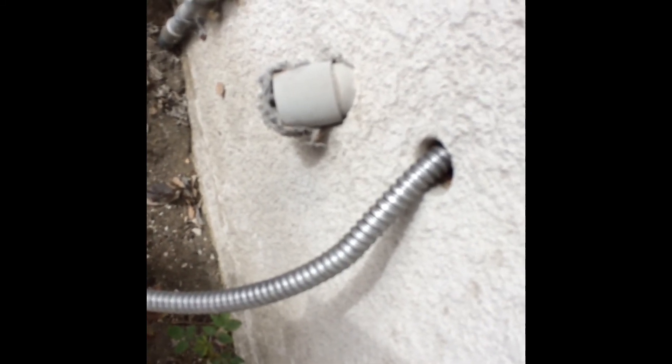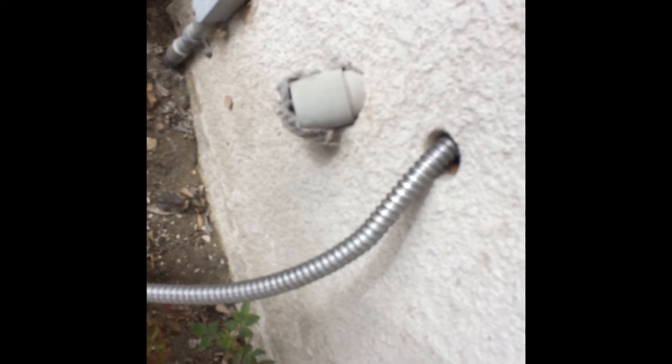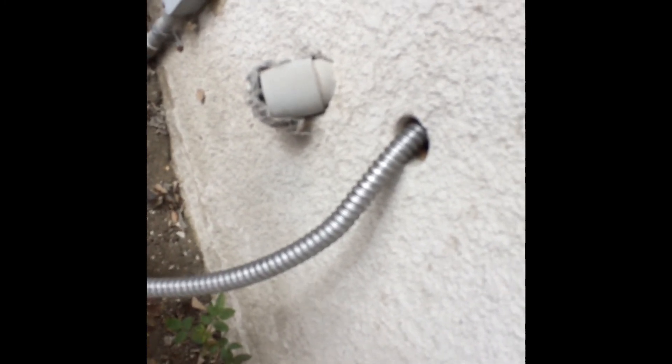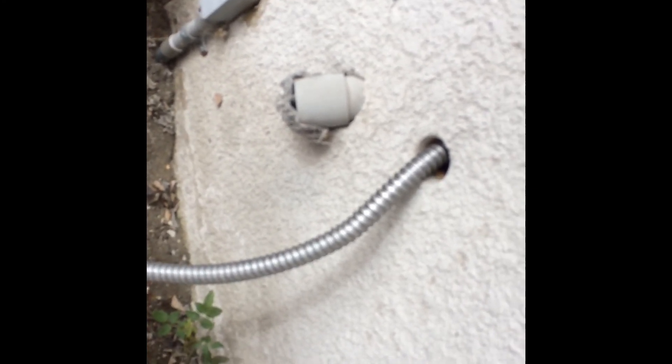I got the fish tape up, but the problem is I can't get the fish tape out of the conduit. My plan now is to cut a pretty big length of fish tape off — enough so that when I cut the flex, I can still feed the fish tape down, even though I can't feed it back up. I'll cut a big enough piece to feed it through and pull the fish tape remnant out. It's really tight getting that bushing in — it's barely going to fit and I may have to disassemble some of the ground. Anyway, it's not simple.